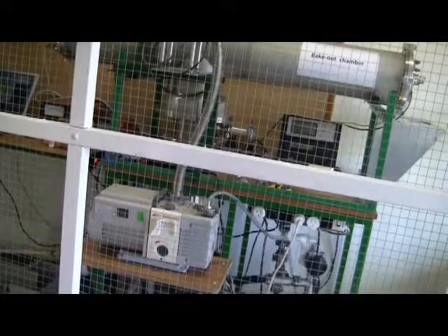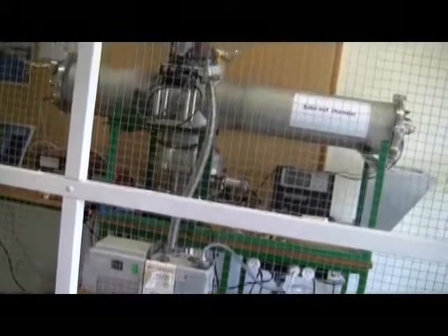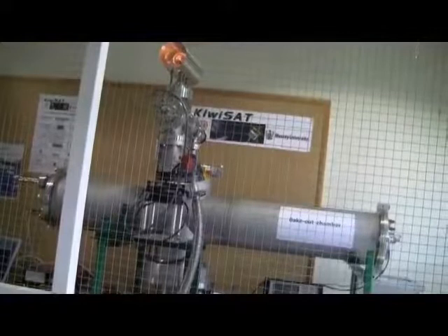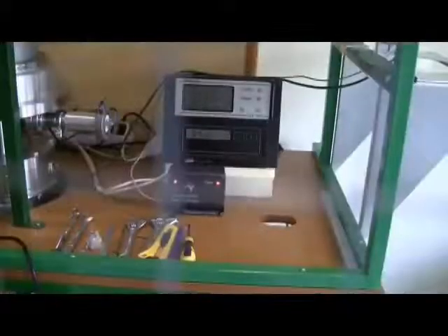This is the pump running, and you can see why I was banished to the foyer of the building — it is rather noisy. The pump just disappearing in the bottom left is the roughing pump, which removes most of the air down to about 10 to the minus 2 torr, and the one right in front of you behind the red indicator is the turbo pump, which takes it to minus 5 or minus 6.